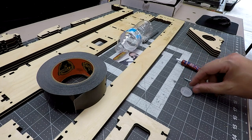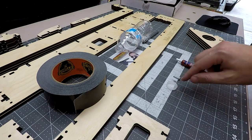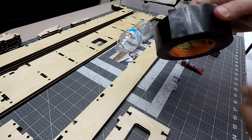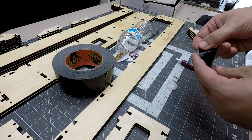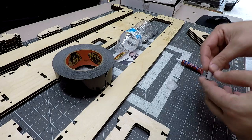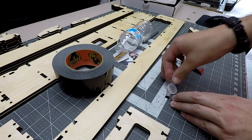Now then, the problem with this is sometimes it's going to want to move around like that. We don't want that to happen when we've got our Loctite in there. So if we take a little bit of duct tape, tear off a piece, and roll that up, we can now place this down, and if you do it at a bit of an angle, it'll be perfect